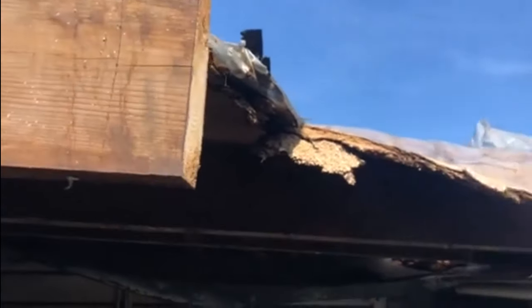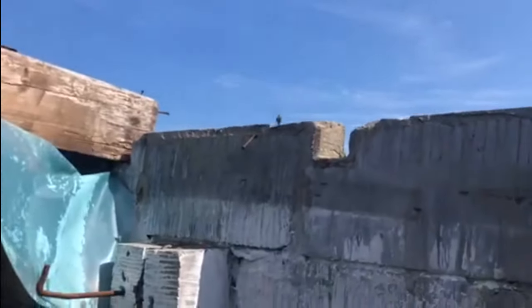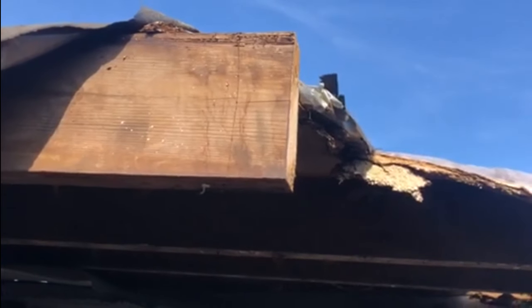As you can see, this one pretty much ends there and there's nothing across that notch in the top of the wall. I cut that off yesterday — it was absolutely rotten, and there's the remains of it. I've also cut the length of wood that's going to be the replacement for it. So today's job is to get the bit of metal channel on the bottom of that bit, cut that joist up there, and then join the two together with a sister joint — a bit of drilling, a bit of screwing.